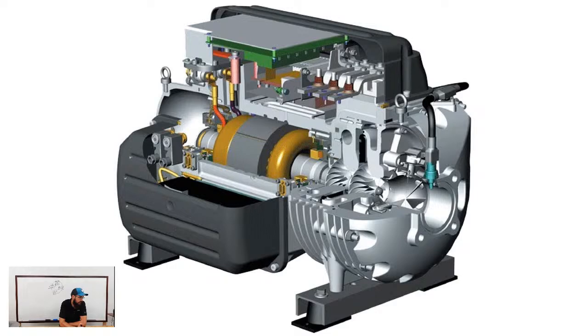Daikin's good. How does York YK compare to YZ or YMC squared for large ton chillers in terms of efficiency? So the YK is good. It's fairly balanced. But genuinely, the YZ and the YMC were built for robust efficiencies. Not that the YK is not. I think the YK and YZ would be fairly comparable. If you're going to spend the money, you're not going to go wrong with any of the three.